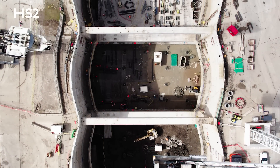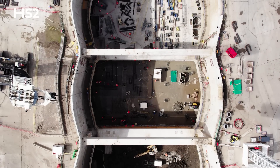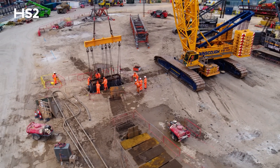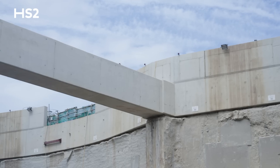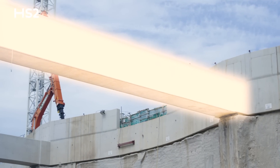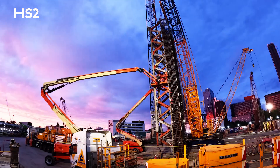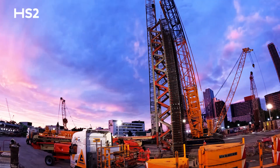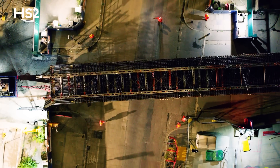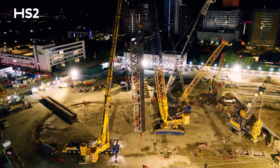After that we mobilised a diaphragm walling contractor and we built all of these walls that you can see around me from ground level using diaphragm walling techniques. The biggest challenge during the construction of the diaphragm walls was the construction of the buttresses, which you can see at either ends of the props. Those involved a 100 tonne lift for each cage, and we had to build our own on-site manufacturing facility to build those cages and then transport them across Victoria Road using an SPMT — a self-propelled mobile transporter with 128 wheels.